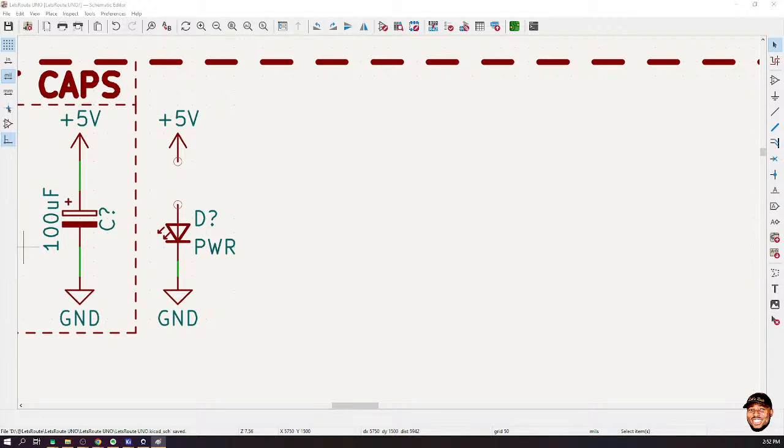If we drop 2 volts across the LED, we would have an excess of 3 volts, and that 3 volts is what we need this resistor to handle. Since these two are in series, the same 10 milliamps of current is going to flow through the resistor. Tomorrow, for those who don't know, we are going to talk about Ohm's law.